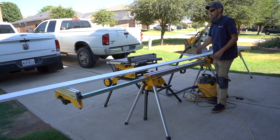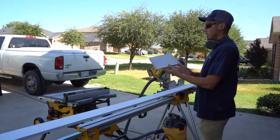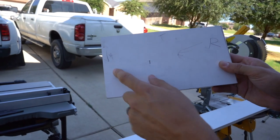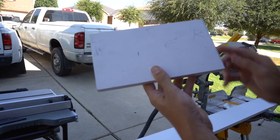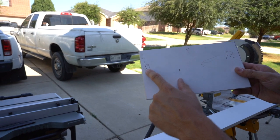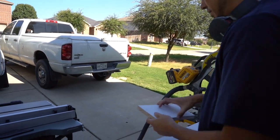We're going to start with our top rail. I always make these little off-cut blocks to find the miter against the wall. I put a T right here — this is for my top rail, this is the right side, and this is the left side. This one right here is going to have that angle on it. I'm just going to make that angle on my miter saw, line up my blade with that, and cut it. The left side I just put a star because there's no miter I have to find there.